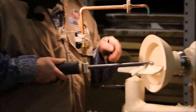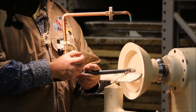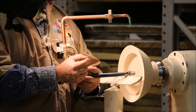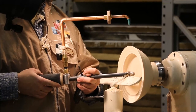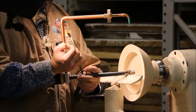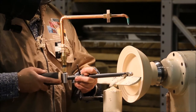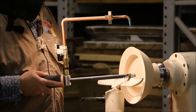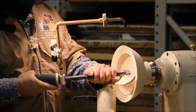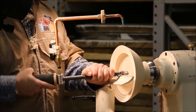What I do is, when I'm doing a real hollow form, when I first put it in at the very beginning, I watch very carefully how thick the wall appears to be — the distance between the laser and the outside wall — and that first little section where I can put my finger in there and feel it. Once I put my finger in there and feel it, I say, oh, the laser is reading a half inch but it's really a quarter inch. So I just subtract a quarter inch in my mind all the way around. I use that first section where I can stick my finger in to calibrate the laser. The laser should ideally be pointing directly down, but really it doesn't have to be perfect.